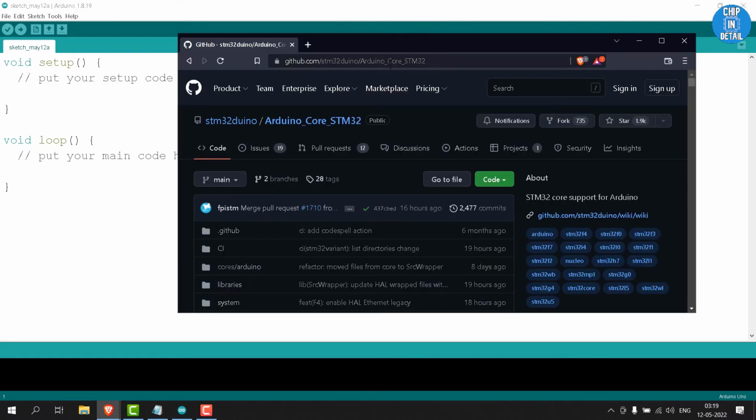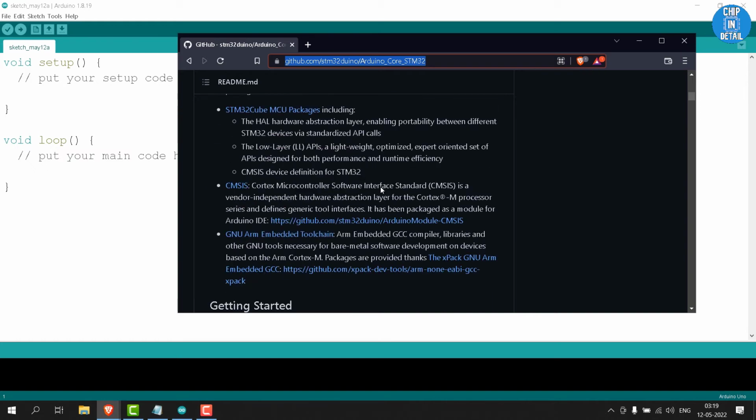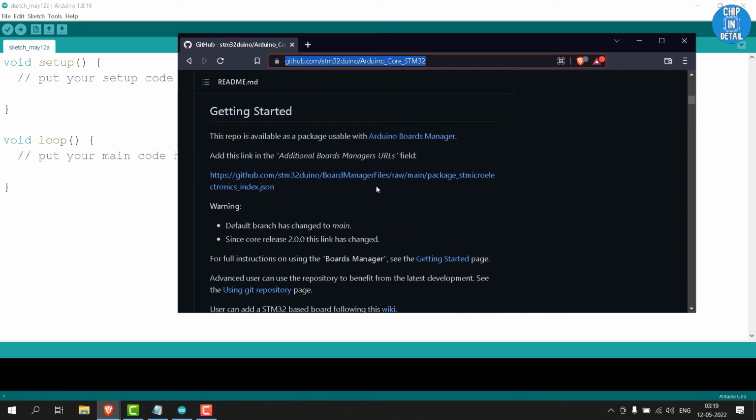There will be a GitHub page like this as the first result. Scroll down and under Getting Started, there will be a GitHub link to an index.json file. We need to copy this and use this in the Arduino IDE to pull the necessary SDK for working with STM32 on Arduino IDE. For now, just copy this link and save it. I have provided all the links in the description.